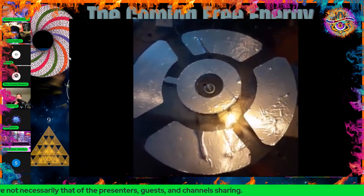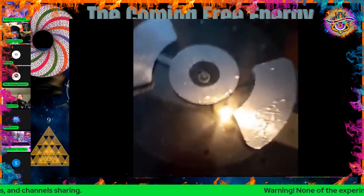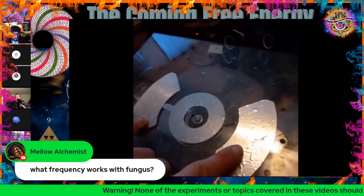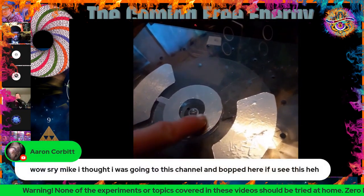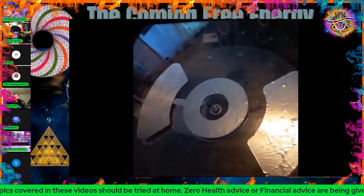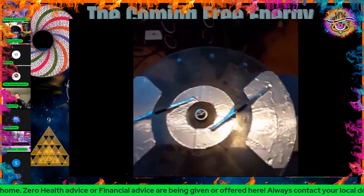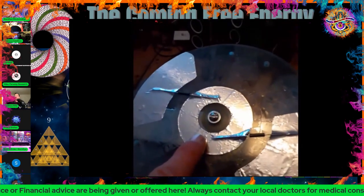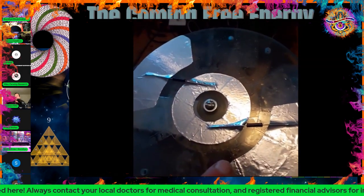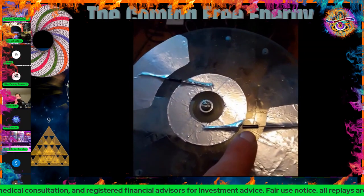Recommended that you just play that video. And what we're looking at there is one of those sets of pads on a small, looks like CD-ROM, and it's on the underside hooked up to a motor. And those pads are the same size as the ones on the top of this large insulating piece of plastic. And you can see they're connected with diodes here, so that one ends up being continuously positive, the other one continuously negative. When there's a difference, the charge flows from one to the other, and so there's a large electric potential that can't escape those plates. It's just sort of stuck on those plates that we're looking at right there.